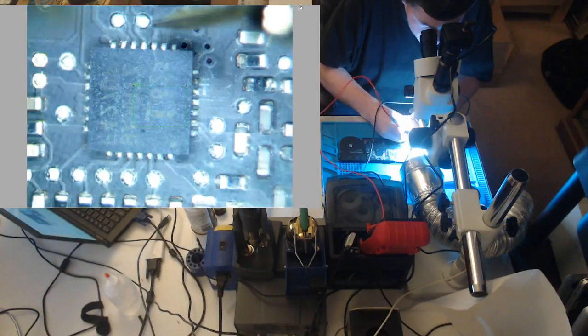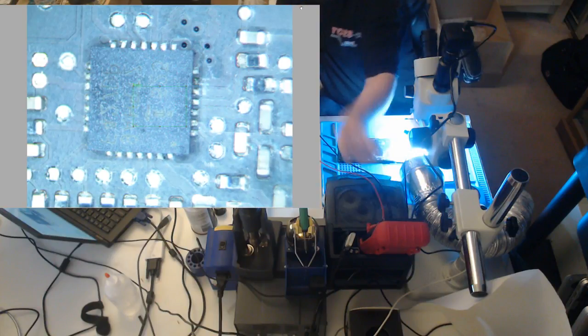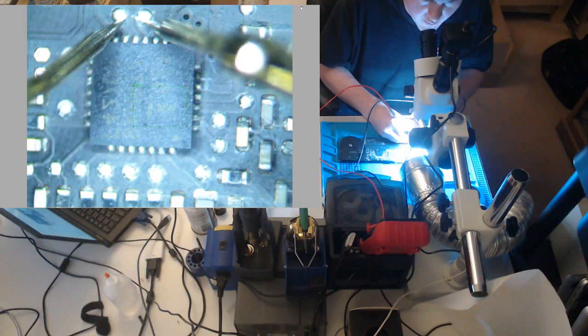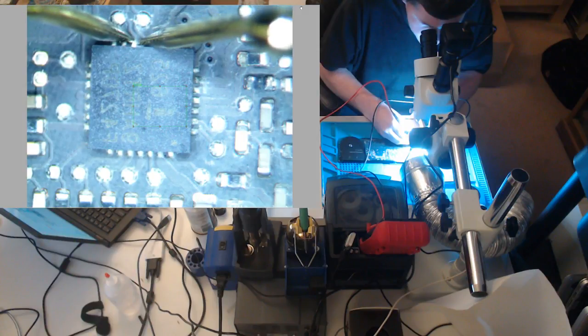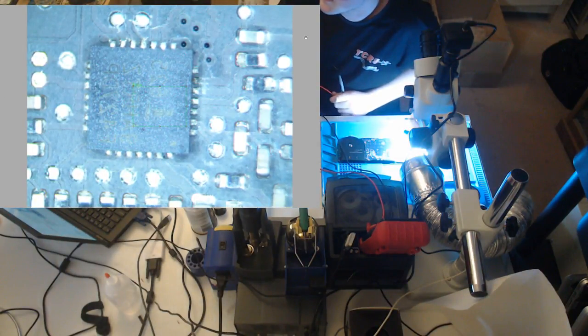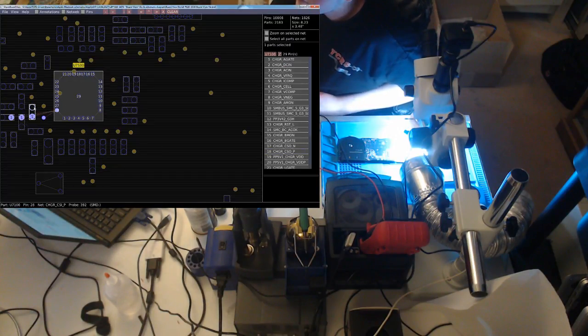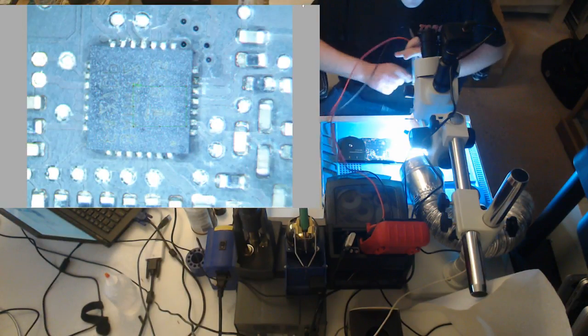So we're going to look here. So let's just see, we need resistance mode, not diode mode. We have 4.9 ohms right there. The path to the chip looks pretty good, but we'll check anyway. 4.5 ohms, that's within limits. I like to see about 3, sometimes less than 3, but 4.5, that is not going to cause our issue. So next one is over here. This should be about 22.